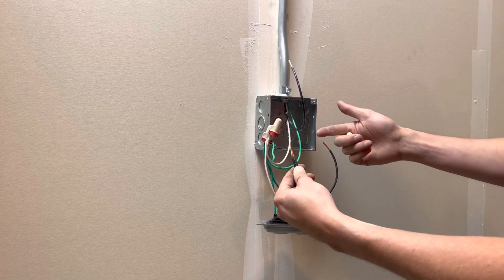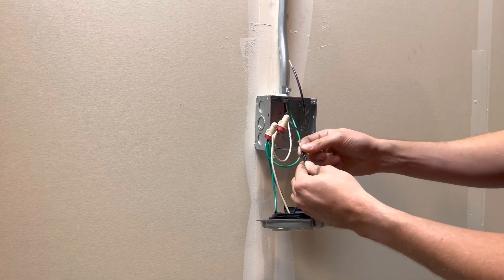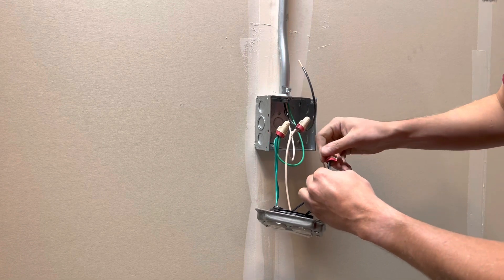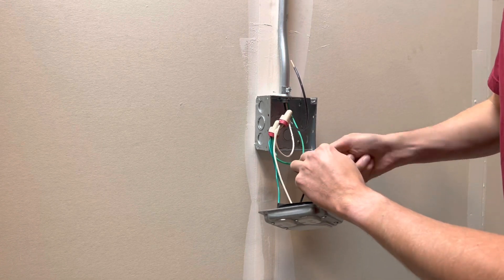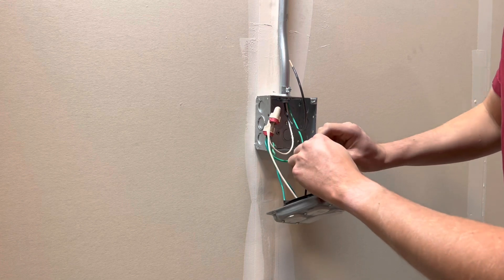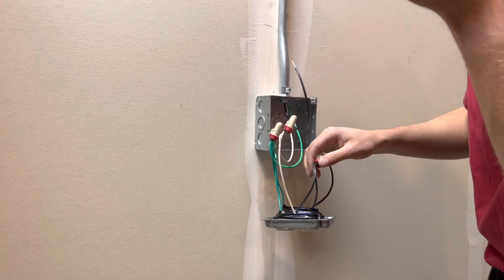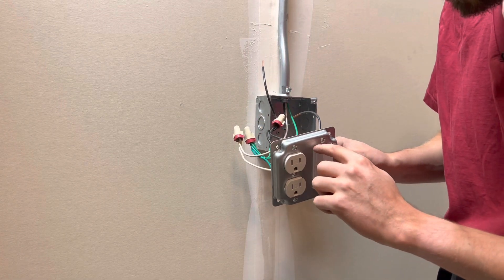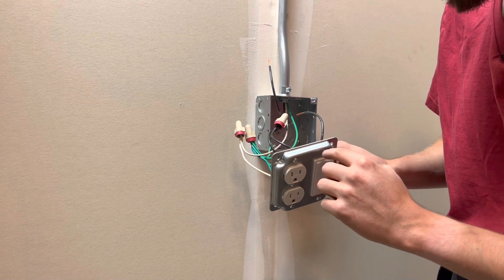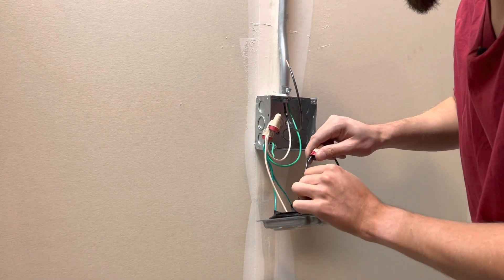I might have to change the wire and I might also have to flip the switch over just for my exact scenario, because I'm using a three-way instead of a single pole. You're always going to want to use your single pole — there are some switches that are different. Most of the time your ground wire is going to be at the top, but the device will say on your single pole switches it will say 'top,' so you know which direction to put your switches because they are directional.